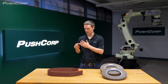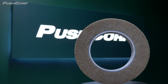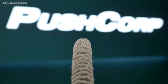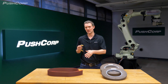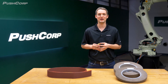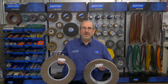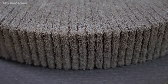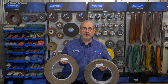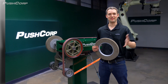Step two was to create the brushed metal finish. This was accomplished with the Norton Vortex Heavy Duty Flap Wheel. We used the 1 inch wide wheel dressed to a radius to access the inner features of the handle, then switched to the 2 inch wide wheel to quickly cover the flat areas. AO grain non-wovens are awesome, as are some of the silicon carbide versions. The advantages of the flap wheel is the ability to be compliant while at the same time giving real MRR results and measurable RA finishes that appear to be what many industries need to fill the linear satin finishes.